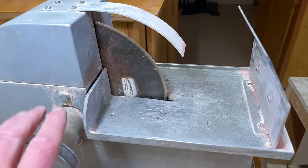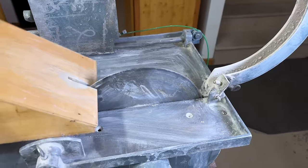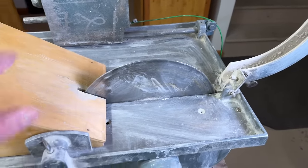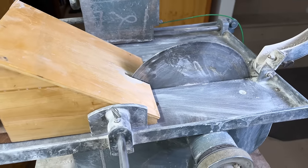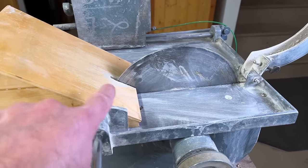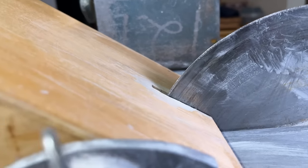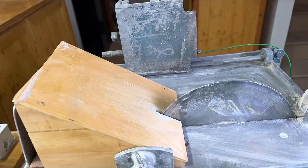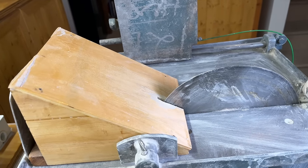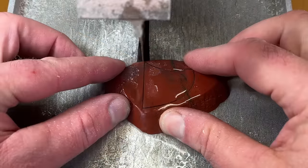They both have their pros and cons, but for this kind of work I really like the Gem Lap. If you have a trim saw, it's not a hopeless situation — you just make yourself a little ramp. I had that saw before this one and my ramp worked well enough to get the job done. You want it angled so it's aiming toward the middle of the blade and at least closer to a 90-degree angle. It depends on your saw, so you have to make it for your own saw — as long as you're close, it'll be good enough.